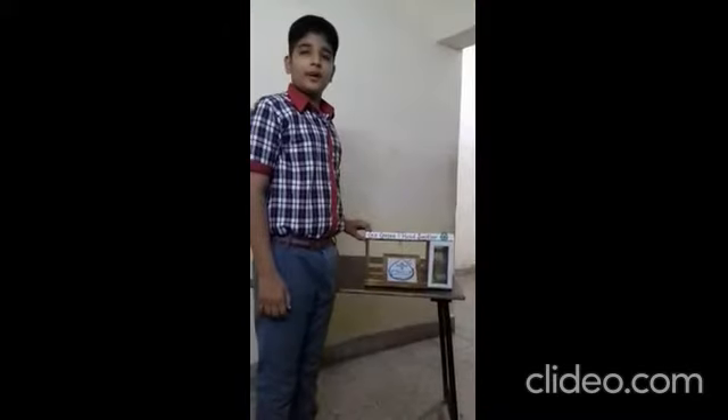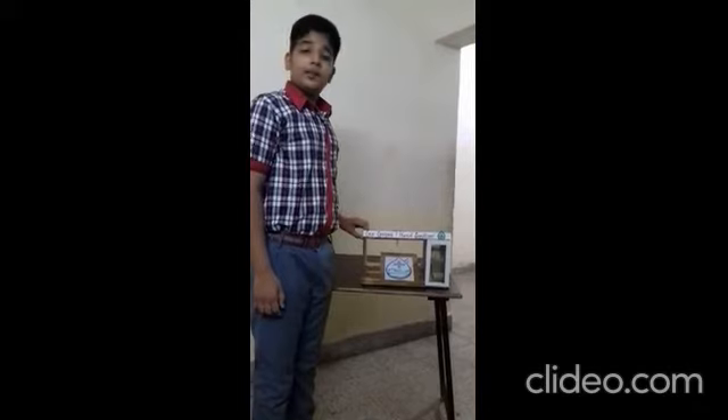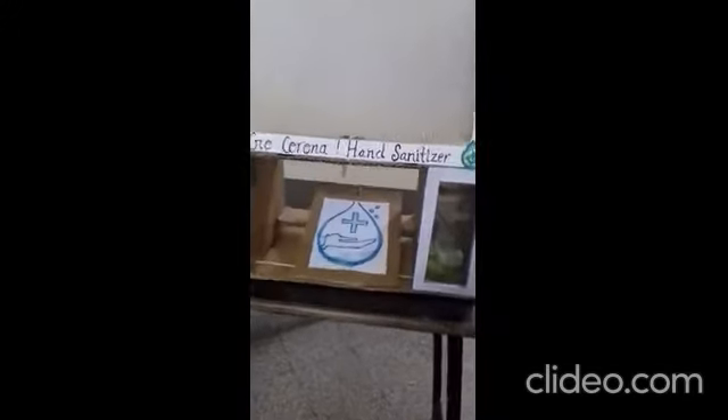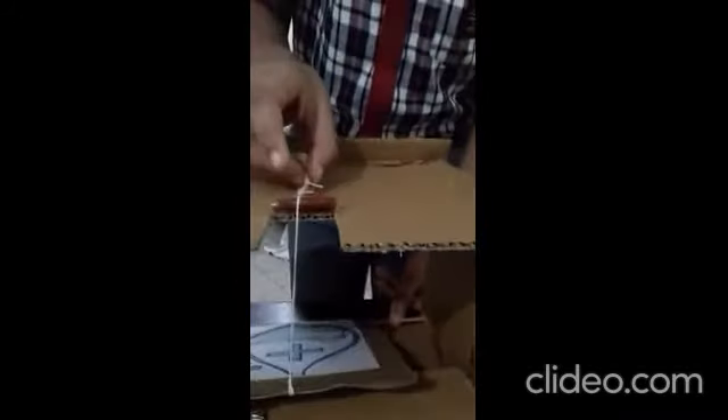I hope you like my game. Thank you. Good morning. My name is Garvitnan, a student of Kendriya Vidyalaya Karnal. I made this project to inspire different institutions to handle the situation of COVID-19. It will work at the main gate of any institution for sanitizing visitors' hands. The things used to make this model are ice cream sticks, rubber band, thread, transparent pipe, foil paper, some wires, mini battery, mini submersible pump, bottle, hand sanitizer, and an injection from which we put sanitizer inside the bottle. The force of the rubber band keeps positive and negative wires separately. But when we press the surface with the back side of our hand, the negative wire and positive wire meet together and the submersible pump starts working and we get sanitizer on our hand. When we take our hand outside, it automatically turns off. Thank you and have a nice day.